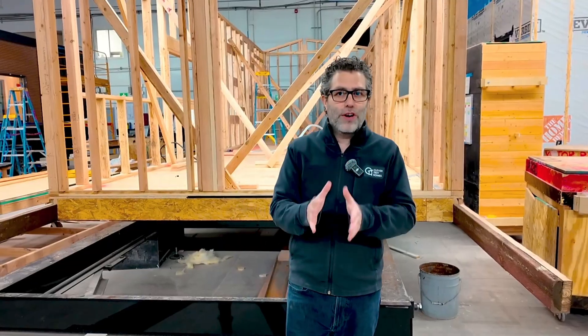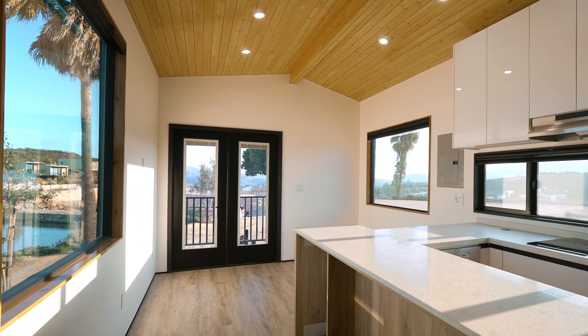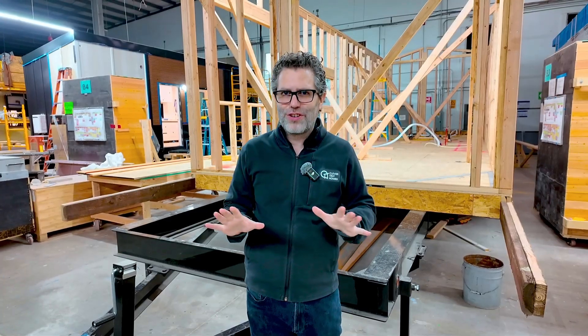Let me talk about how we did not solve it. One very common way in tiny homes or houses on wheels to not have wheel wells is to do what's called a deck-over design. Basically, you have your wheels and axles and then you build the home above — decking over the wheels so the floor deck is above the wheels. This design comes with trade-offs that we were not willing to make. Either your home is over-height, which can be very expensive or sometimes impossible to deliver, or you have to make the ceilings shorter — definitely not a trade-off we're willing to make, as our homes feel really spacious because of the high ceilings. Or you have to use cheap trailer home axles and tiny wheels that don't go very far and do not meet our quality standard.